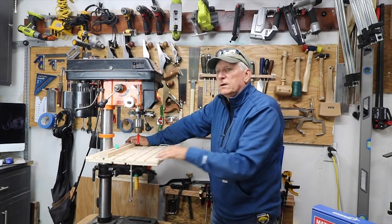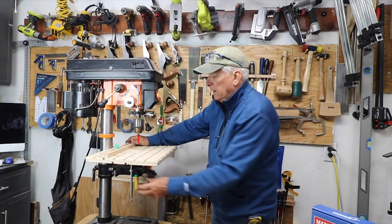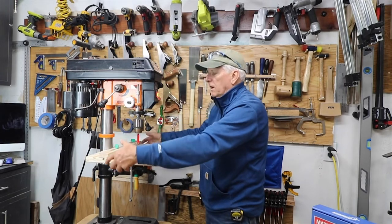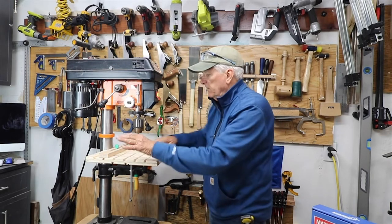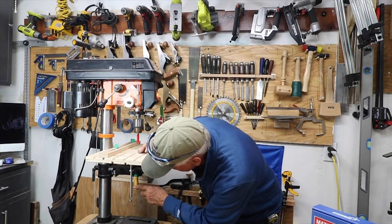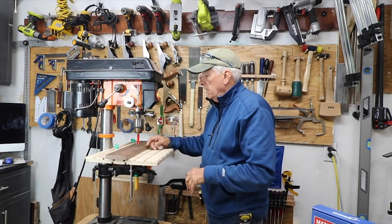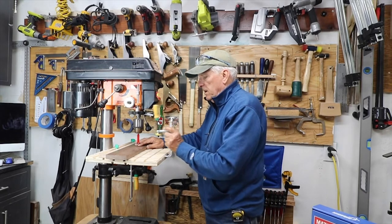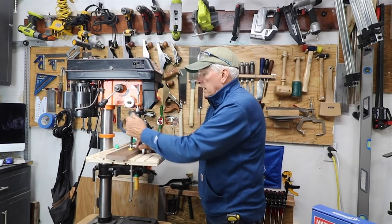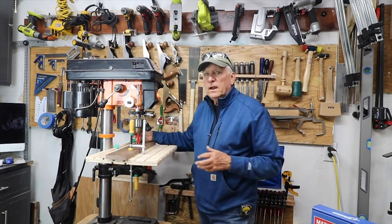The beauty here is you're not having to use T-tracks of all sorts of different sizes. These devices came as part of the kit, so you can cut dovetail slots into a lot of different jigs throughout your workshop and use this same set of clamps. The major advantage is the clamps are low profile and out of your way. I put my work piece up, do my drilling, then slide in the clamp, drop it down, tighten it up, and do the job without having to hold things with my hands.